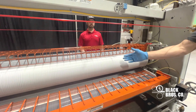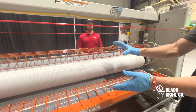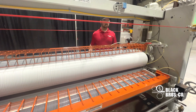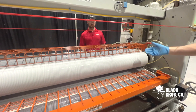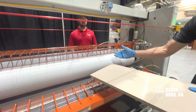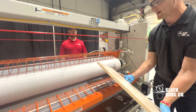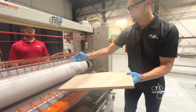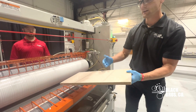What you're seeing here on this roll is sometimes called roping — what's happening is you're over-exceeding what that groove pattern can provide. You can tell I don't really see a groove pattern on the roll anymore. This is a common mistake when you're flooding the roll: you're trying to reach your gram weights and have pushed to the point where the groove pattern is lost. When my operator pushes the part through, you can see what happens when you're trying to put on too much glue — you get a mess. We call this dubbing off — you're pushing adhesive off the back edge or off the sides. This panel can only take so much glue, and you're over-exceeding both the panel capacity and the groove capacity. To correct this, you'll have to cut your coat weight in order to see that groove again.